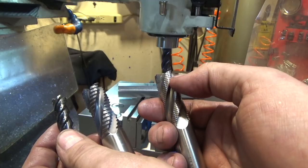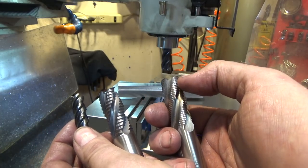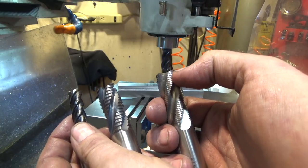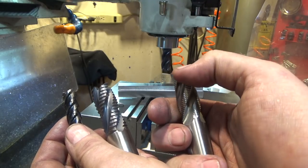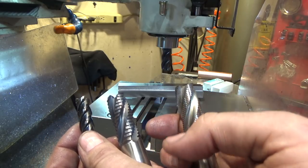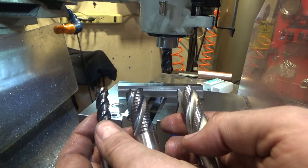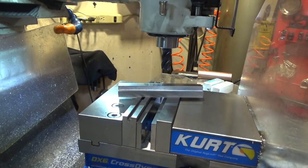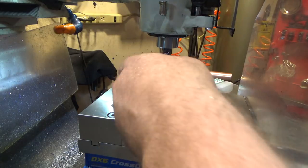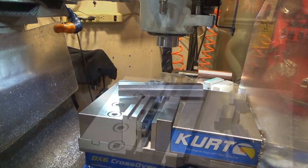And my impression was always that on a roughing end mill, when you've got a peak on this one, that would line up at the valley on the next flute, and maybe they do, but maybe my feed was still a little too fast and my RPMs weren't high enough. I'm not quite sure, but the end result is I still ended up with grooves. So anyways, now we just got to part these 4 bits off and drill and tap for 1/4-20, as I mentioned, and we'll be good with the T-nuts.